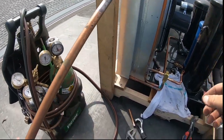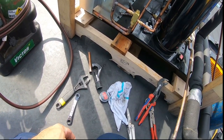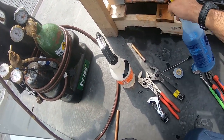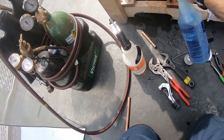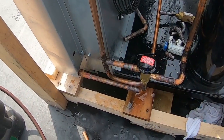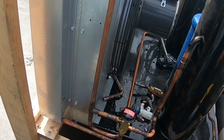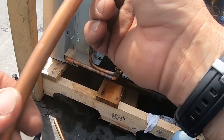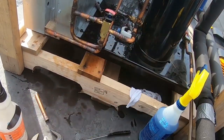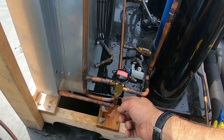That made it a whole lot easier. Our battery went dead so we didn't get all of that on video, but we went ahead and sprayed all of our fittings including the head, put the pin back in there, the push rod, and snugged her up. We preheated the end of the copper and then used the power swage to make that fitting right there — one less fitting to stock, only one solder joint. Got two 90s in there, cleared it up, brought it through, used some paste along with a wet rag.